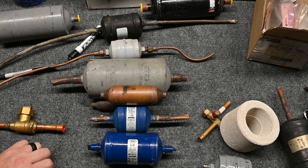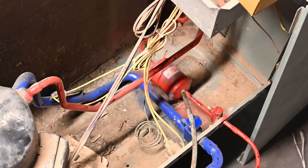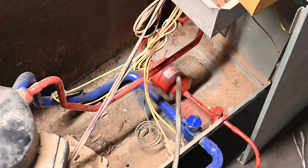Let's take a look real quick at what it looks like when a filter dryer is behind the valve. Here's an example of a filter dryer behind the valve. Let's look at the flow of refrigerant: leaving the condensing unit, into the filter dryer, out of the filter dryer, into the valve, out of the valve, through the liquid line to the house. So my valve is here. If I have to do a pump down — which we'll get to soon — and I close this valve, I have my filter dryer behind the valve. So it's going to be very difficult to change it. I have to take all of the refrigerant out of the system to change this filter dryer, which is quite time consuming. So anytime I have the filter dryer behind the valve, I like to put in a straight piece of pipe and move the new filter dryer outside of this valve.